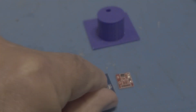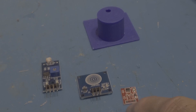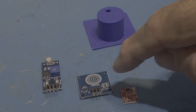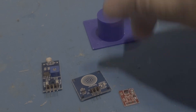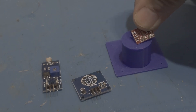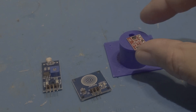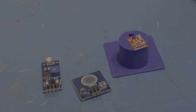Here's the original and here's the new one — compare the sizes. The larger one requires you to solder the plus and minus 5 volts and the signal output. You'll notice all the components are on the back of one, and on the other they're down on the bottom, leaving everything else clear. If you take the smaller one and solder it just slightly below the LED position, it only sticks out maybe a 32nd of an inch.